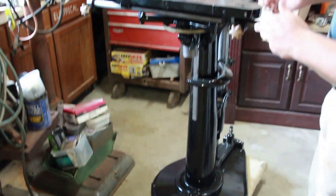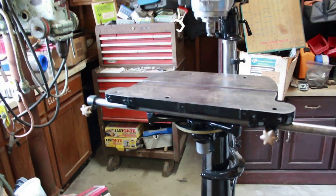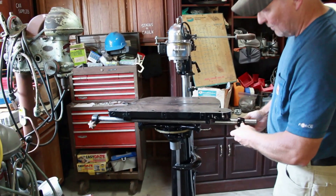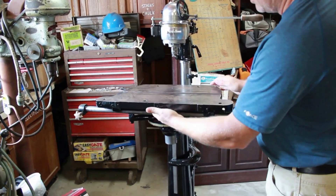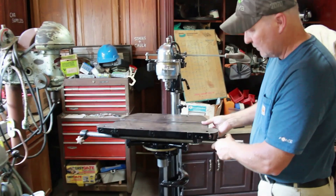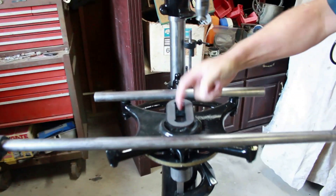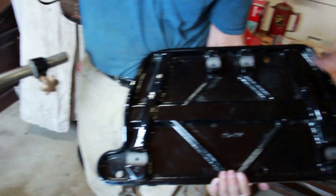It has a slot in the table so you could use a miter gauge with it. I don't have the original miter gauge and I'm not even sure that's what it was for, but it looks like it was either that or a stop — you could use a T-slot stop in it. There are also stops for the table. The only missing piece I know of is a handle that's broken up under the table, which you would pull to allow the table to slide back and forth. This mechanism engages the bottom of the table and the table slides on these rails.